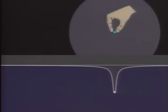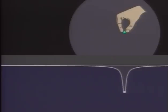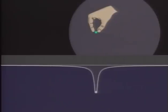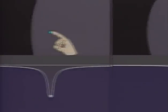But a real electron inside the metal is acted on by all the ions and all the electrons except for itself, leaving itself a net potential energy. If that electron is moved from one part of the metal to another, the other electrons flow around to replace it, so that it has the same potential energy everywhere. That means there's virtually no force to prevent an electron from moving freely through the metal.